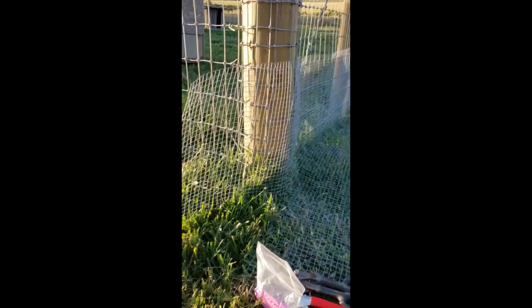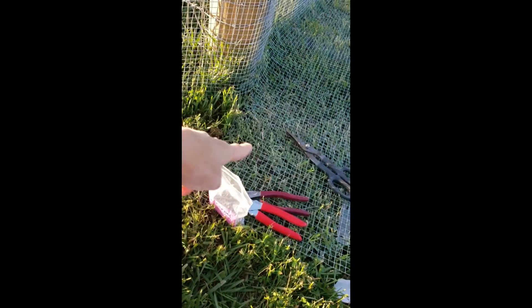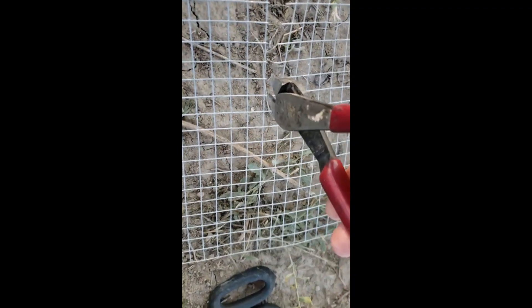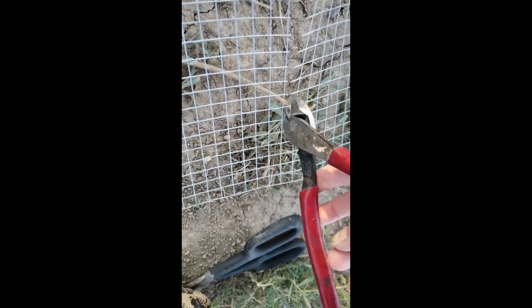The fence has been tightened all the way to the bottom. Now I'll show how I do the ends. This was one solid three-foot section — I use my cutting tool and cut so that part could rest on the ground, then up to the post, and wrap the wire around. That leaves some fencing out at the corner to protect from anyone digging in from the corner. At the other end I left about a foot and a half, then cut all the way to the end to get rid of the extra roll, and I'll do the same thing — cut it to wrap around the post.